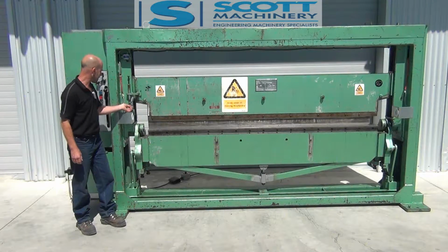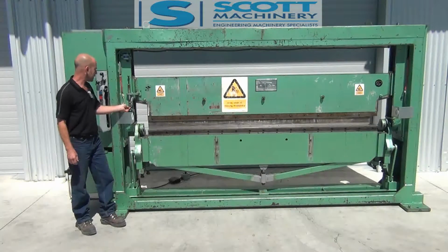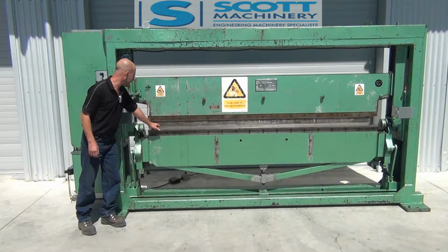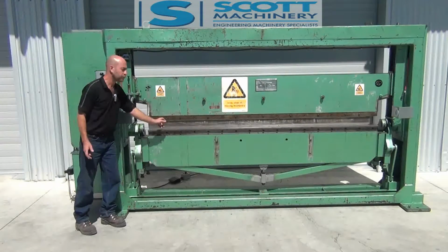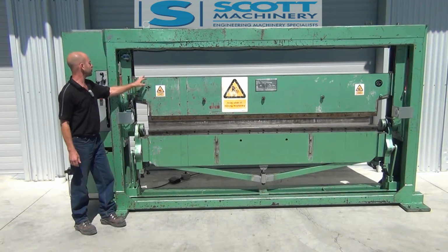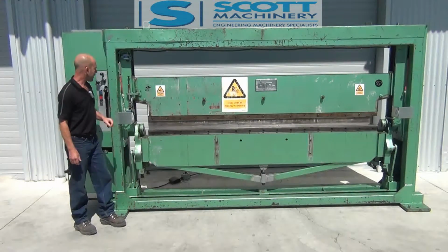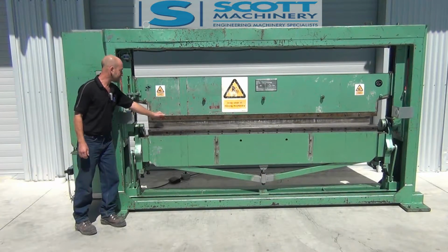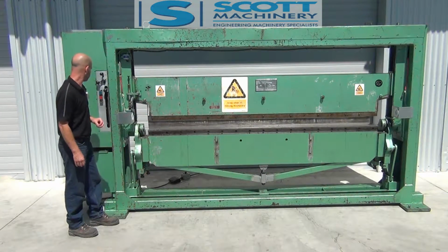You've got some wee spaces here with your named thicknesses of your different metals, and simply that goes under this wee magnet here, which sets the top beam stop position for clamping your material. So it's a really good design. You can adjust how far the top beam goes up. And obviously those shims that you put under there, your thickness for your material decides its clamping pressure.